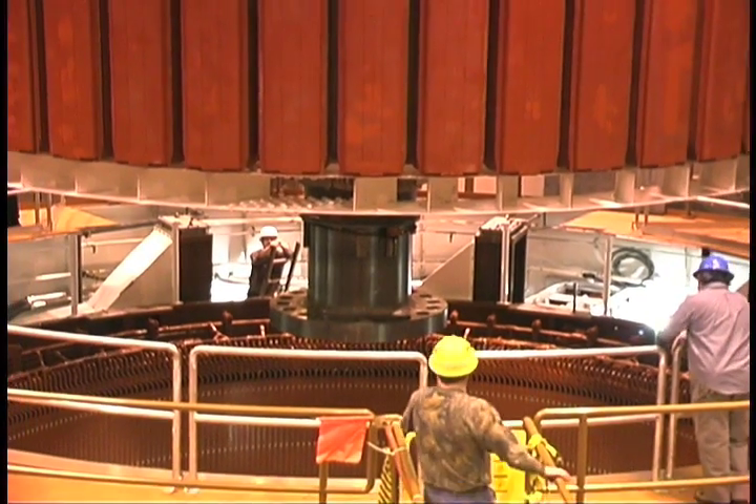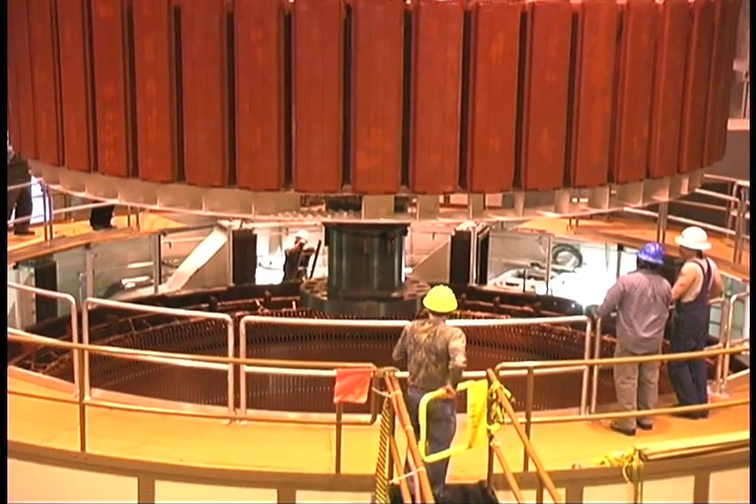Oren Wilson, Ross Generation Supervisor, says it's all part of keeping the machines reliable. We went through some rebuilds in the 90s where they replaced runners on some equipment and did upgrades to others. Runners are the turbine part. Then they went through and just cleaned things up and checked them out, and based on those inspections is where they made the determination to do this generator rewind.